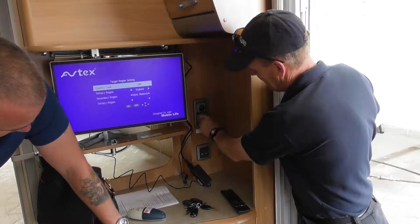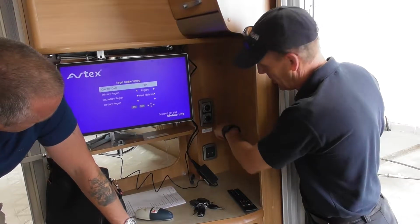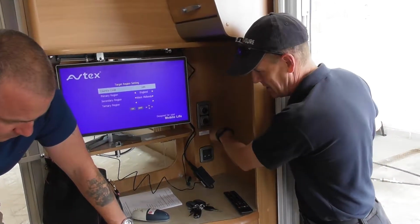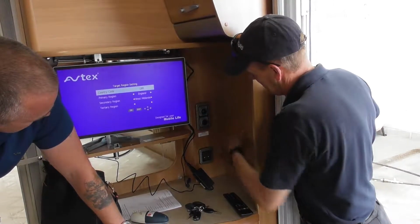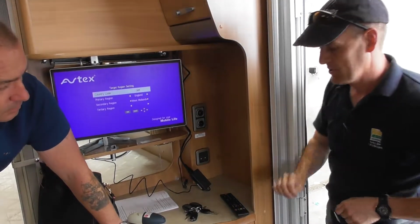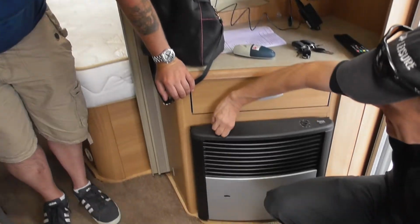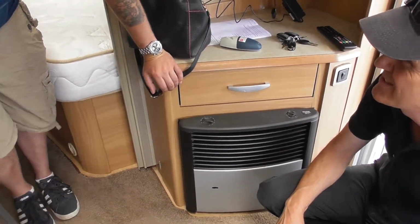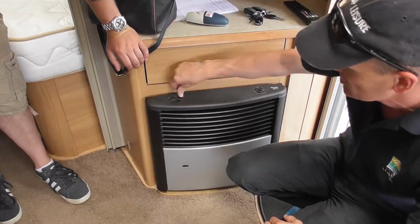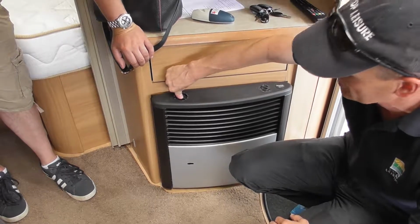Thermostat control: whatever number's against the green light, so if it's 9, that's the highest setting, or 1, the lowest setting. You can hear the click then. Otherwise, thermostat is off. If you want to, you can run the fire off gas. So this side is the control for gas. If I turn that to there now, can you hear it clicking? Yeah. So that's the igniter waiting to ignite the gas. Depress the button. Hear the clicking stopped. I don't know if you just heard the gas fire up.